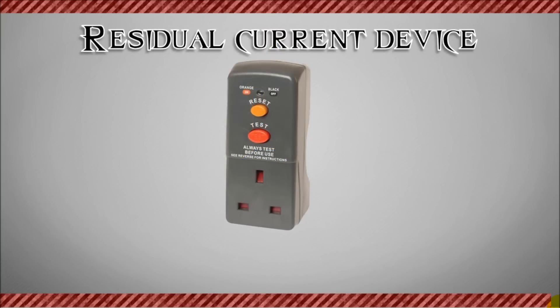One of the things you can do to make yourself safer is to buy a residual current device. This is very much like the trip or circuit breaker you have in your house. If there are any problems or crossed wires, it will trip and cut the electric supply to the relay board. This isn't the only safety measure you should use — use anything you'd normally do to protect yourself against a mains power supply — but it's definitely something I'd recommend buying before embarking on this project.